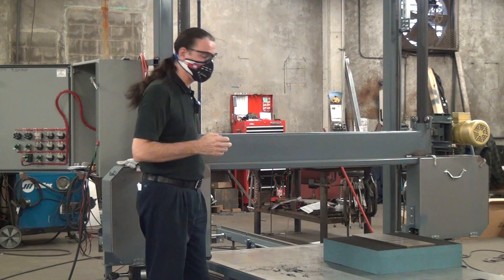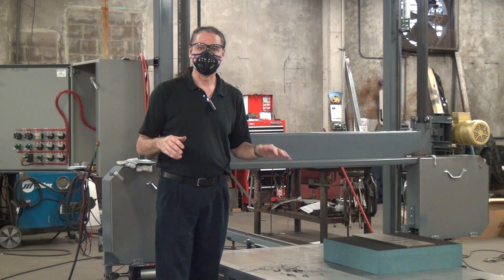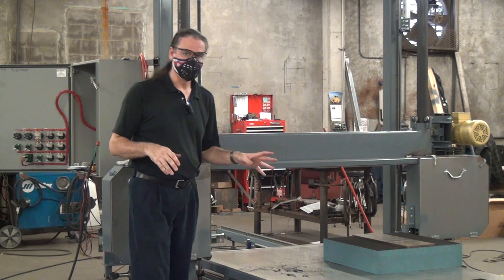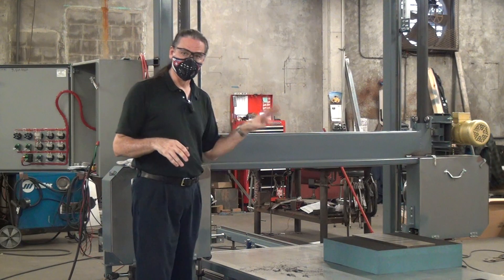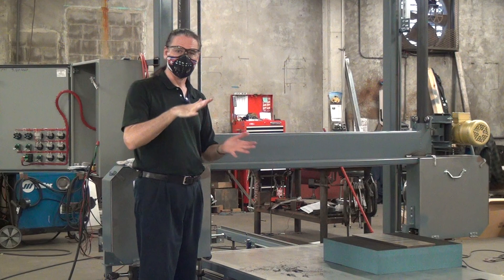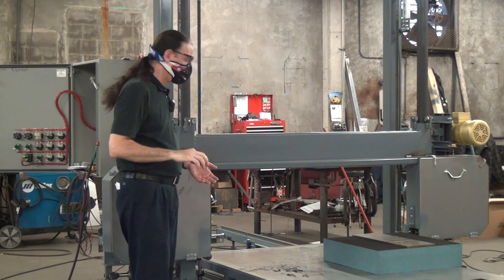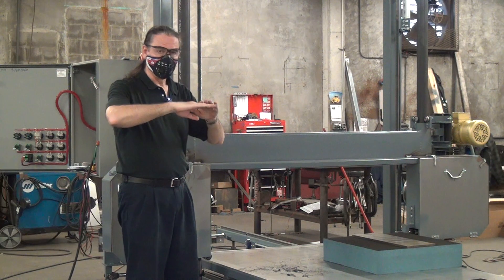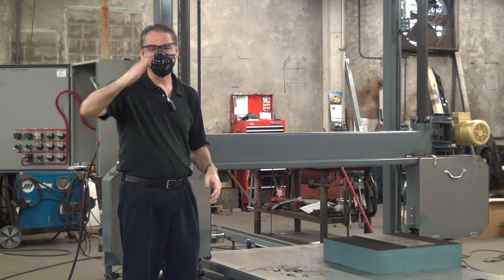The ideal for this application would be a vacuum surface to hold the work piece down. The weight is not ideal — I certainly would not recommend a weight if this was a really springy, squishy foam, because it doesn't really deform this rigid material much and doesn't pinch the blade. With seat cushion foam, throwing a weight on creates a divot, you make a nice straight cut, but as soon as you take the weight off, the foam springs back and you find you've got a mound where the weight was.